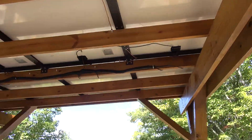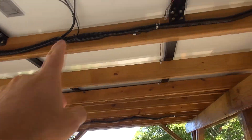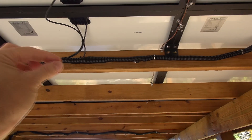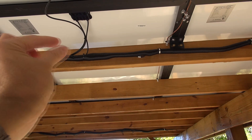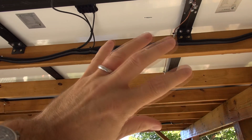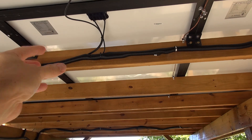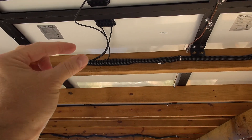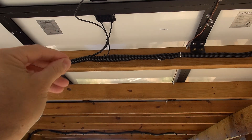I've put the wiring in looms, but be mindful: one big catch here — this is where we get into arc fault protection. If you have any breaks in your insulation, whether from rodents, weather, or UV, you can easily have a DC arc fault. If there's anything flammable nearby, that can cause a huge fire. Just go and research DC arc faults and solar arrays to see how many fires have been caused by this issue — that's why we're going to do a separate video on DC arcs and arc fault protection.